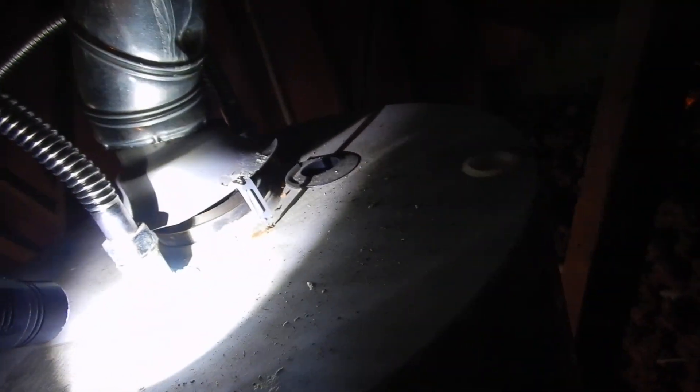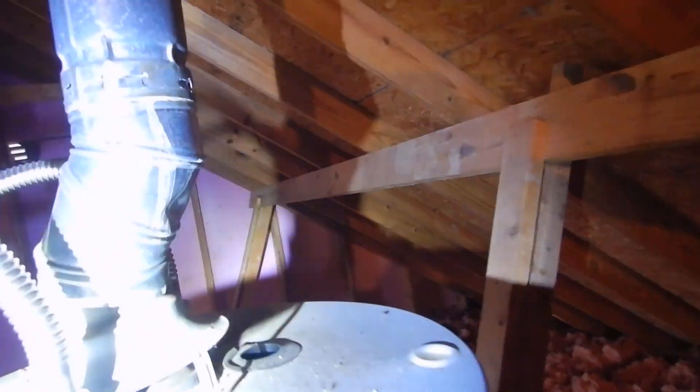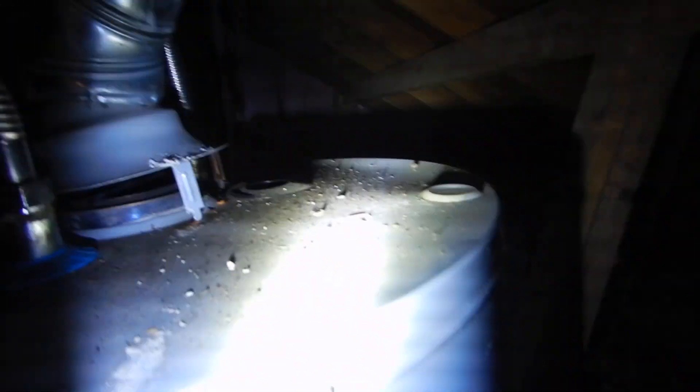No care and use manual. Too many bends in the TPR. No air gap in the TPR. No insulation on the TPR — and it leaks. No insulation on the connectors next to the tank. Looks like there's a little bit of corrosion starting right there. Our draft hood doesn't connect well and it's not properly supported in the attic. Seven years old — they last about 10. It might last 12, it might last 15, it might go out tomorrow.